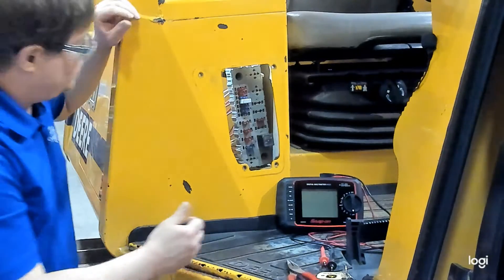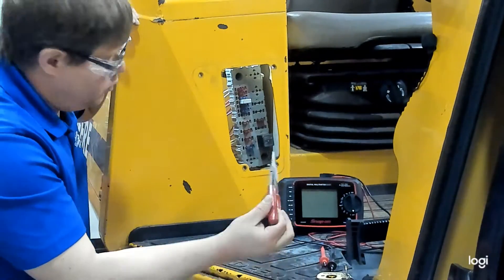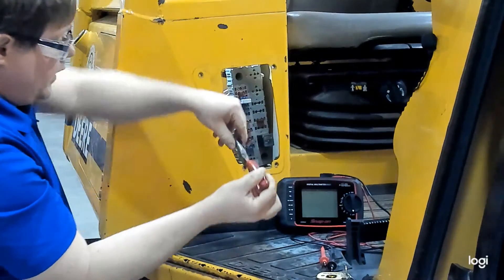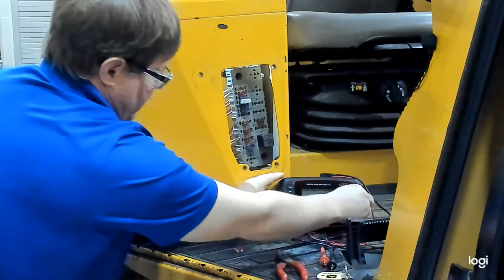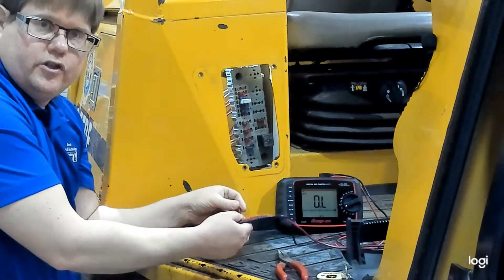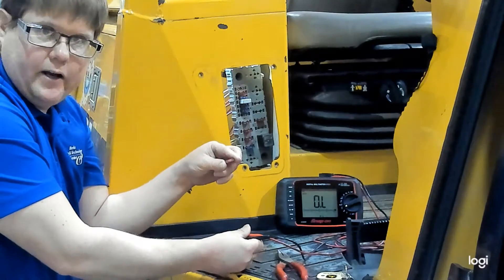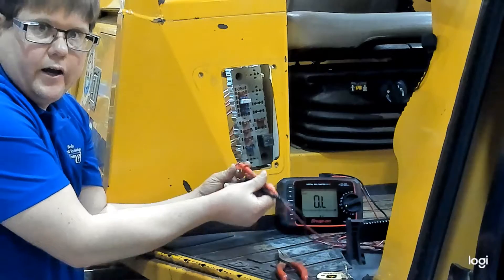The way to test a fuse would be to remove the fuse. You can remove it by hand or use needle nose pliers to pull it out if you can't quite get to it. You can use an ohmmeter to ohm it out, so we're going to turn our multimeter to ohms. A fuse is used to protect the circuit — it will have a path for electrical flow through it, but if the fuse exceeds the rating (this is a 10 amp fuse), it is designed so that the filament in there will break and interrupt that path.